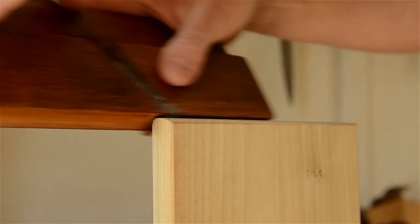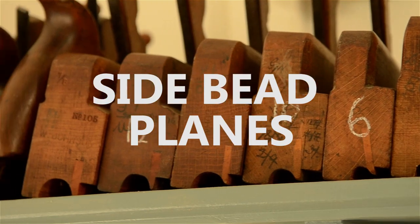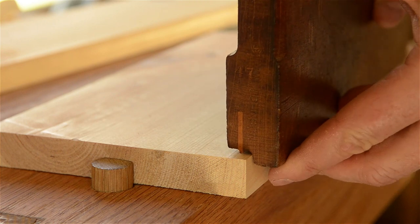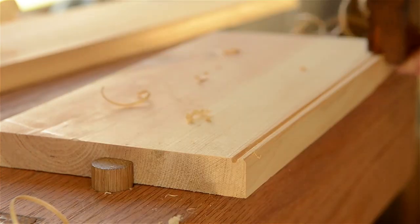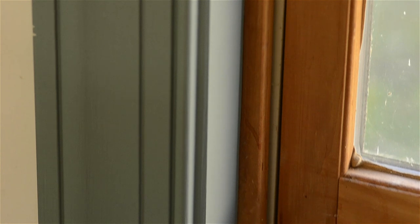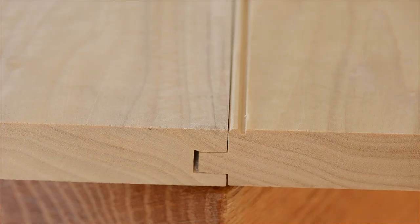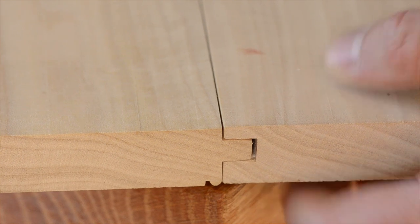The skewed style will work better if you plan on creating a molding all the way around a table top or box lid. The last style of molding plane I'm going to talk about is called a side bead plane, or also just a beading plane. It cuts a bead shape on the edge of boards to reduce the chance of damage and also for decorative purposes. There is a very good chance that you have beads cut into the windows and door moldings around your home — just go have a look. You can also see that beads are a great way to decorate an otherwise ugly tongue-and-groove joint or a shiplap joint.